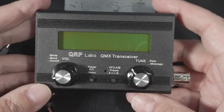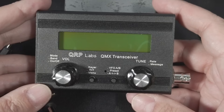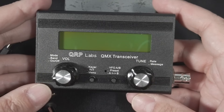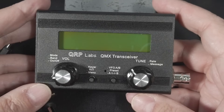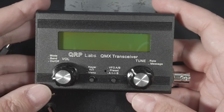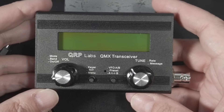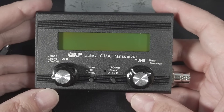A lot of folks don't realize that and end up scratching their heads until they read the manual. So if you've got a LiFePO4 battery or something like that, you're going to need a buck converter to step the voltage down below 13 volts, or use a battery that puts out less voltage like a lead-acid battery. In my opinion, that's one of the two annoyances this rig has. The rig draws 80 milliamps on receive and 700 milliamps on transmit at 12 volts. If configured for 9 volts, it draws 1 amp on transmit.